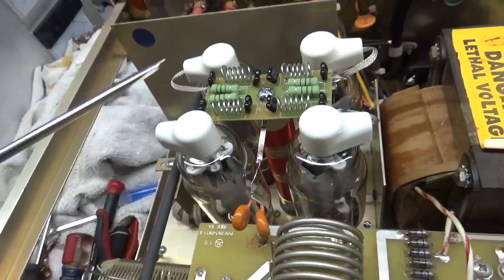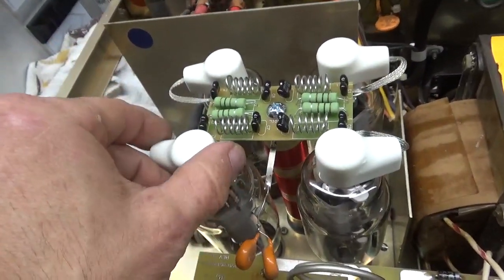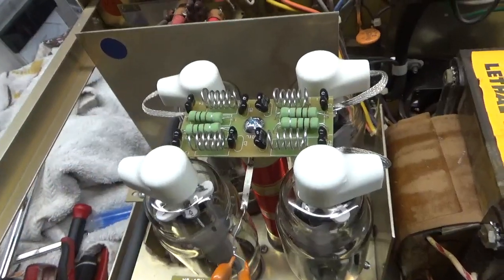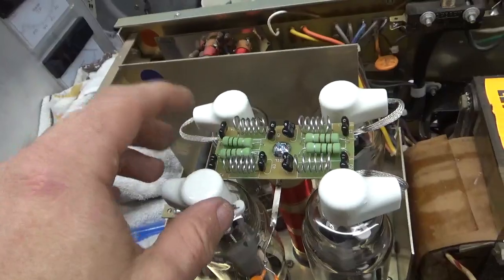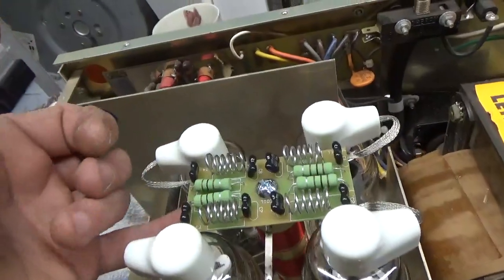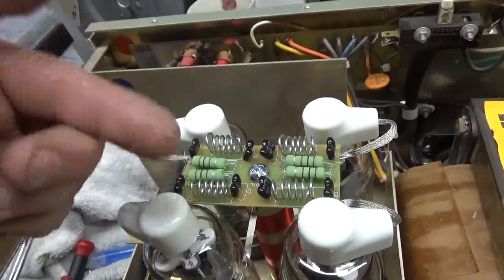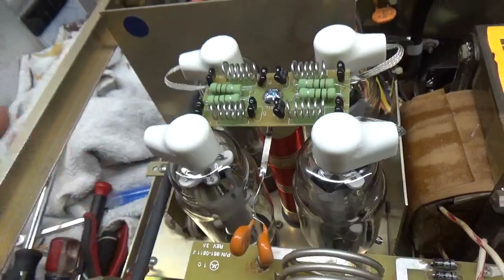When I go to ship this back, you don't ever want to twist these caps back - you want to get underneath and wiggle them back and forth, just carefully get them up, because they're going to be really tight. When you go to remove the tube, sometimes they're loose and they pop right off, and that's not good - you want to make sure you have a good connection. I end up taping these underneath with electrical tape or blue tape or packing tape, just a couple wraps underneath, so they're not dangling and whacking the plate choke or each other.